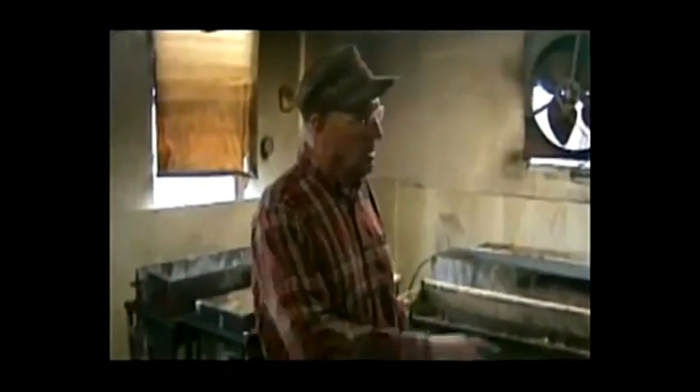Today we're in the salt bluing room — we do it all here: rust blue and salt blue. Bluing is just a dirty, nasty job. We keep it in a separate room, away from the rest of the shop. We've got all sorts of tanks here: a degreaser tank, a hot water tank for boiling out, another degreaser tank — we have several because we do so much at one time and run mass production. There's also a cold water rinse tank.